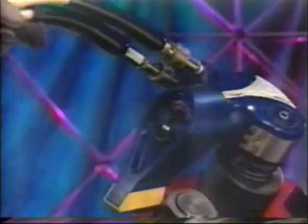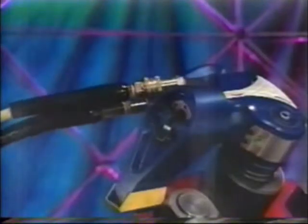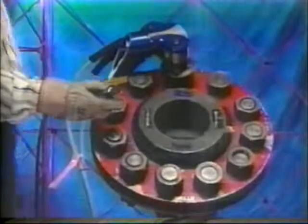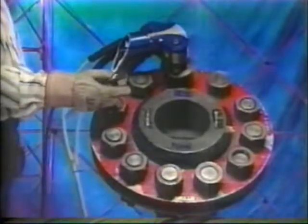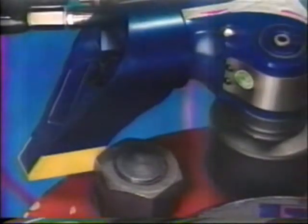Check to see if the reaction arm is firmly abutted against a stationary object, and make sure that hose connections are clear of any obstructions. Clear away from the MXT and apply momentary pressure to ensure proper tool placement. By pushing down on the remote button in the advanced position, the rear of the MXT will be pushed back until its reaction arm contacts the reaction point.